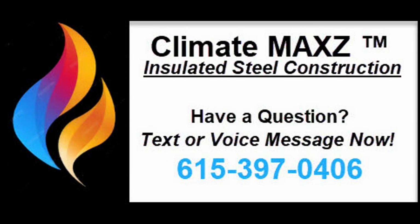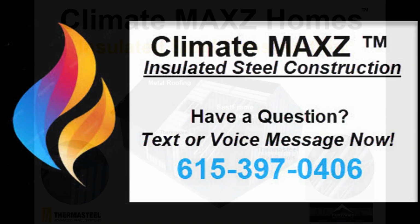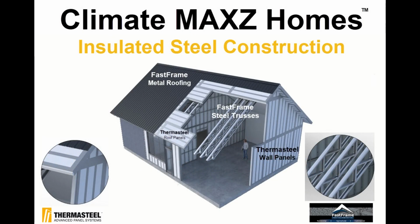But anyway, let's get on with the program, and we're going to go through the two basic building materials we use for the frame and the outer shell of the Climate Max home. All right, we're going to jump right into this, and here you see the real strength of the Climate Max home. This is the shell, the protective shell of the house and supportive structure, and it is made up of two components. One is the ThermoSteel insulated steel panels that go on the walls and on the roof, and the roof is all supported by Fast Frame steel trusses.